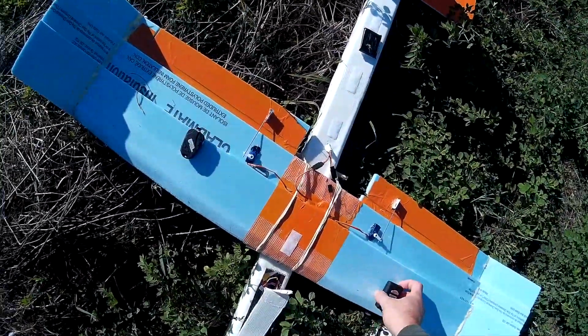All right, so end of flight synopsis here. Flew well, flew very slow. If I want to fly faster, I'm going to need a faster motor on this, or I'm going to need to swing a slightly larger prop. But overall, I'm pleased, especially in low wind conditions. It's pretty much an ideal platform for doing some nice stable FPV. So hopefully I'll get a wind-free day this weekend.